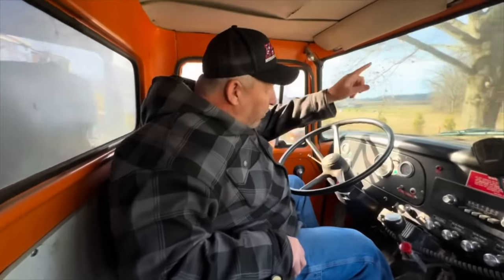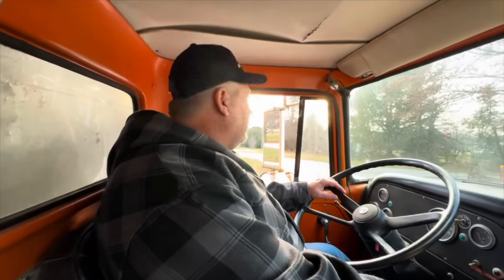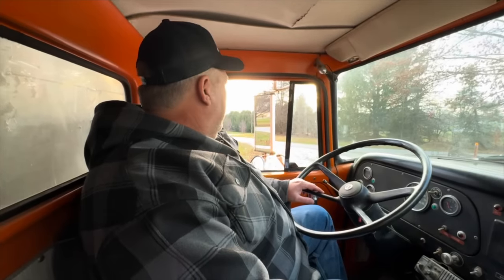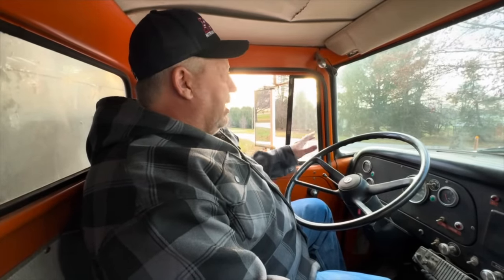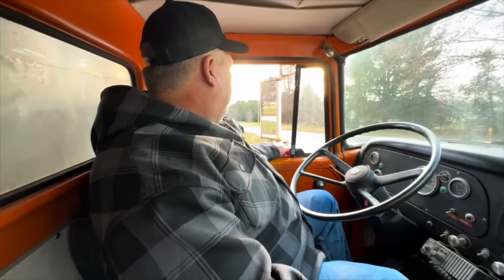Gotta make sure we get the bed down before we get to the tree limbs. You don't get to do this every day. So why is the stuff you just laid a different color than the stuff you laid earlier? When you buy limestone from the quarry, they wash it and run it through a machine that wets it — that's to keep the dust down while you're spreading and loading it. So when it comes out of the quarry, it's always got a little water to it. Once it dries, it dries a lighter color. It'll all be that nice white color and it'll all match.